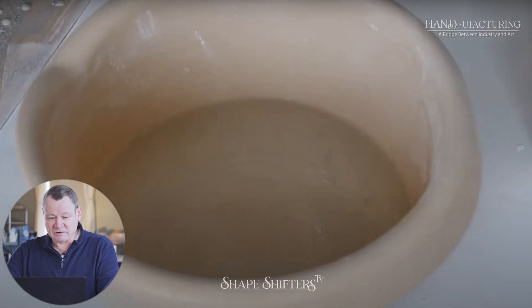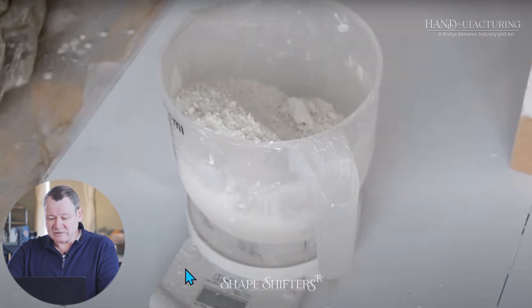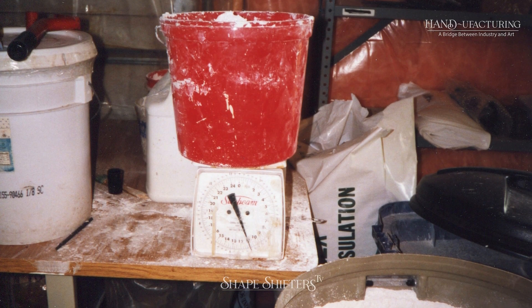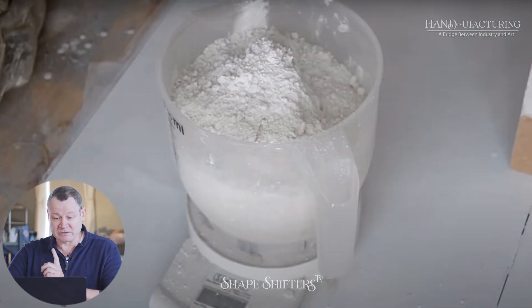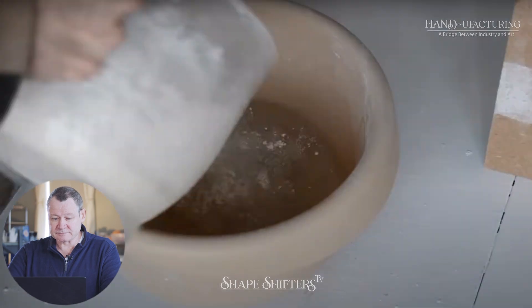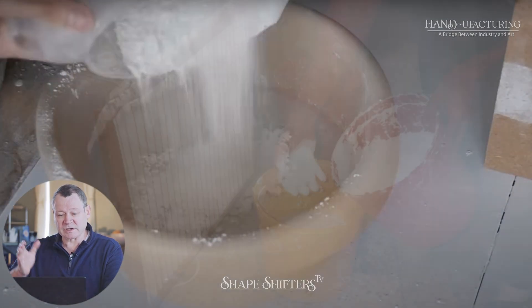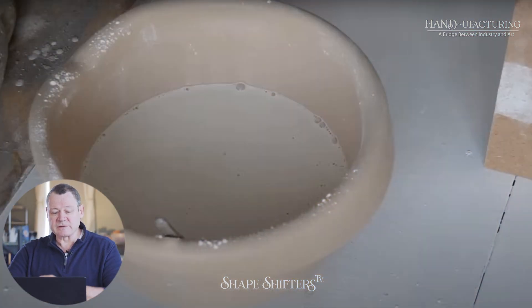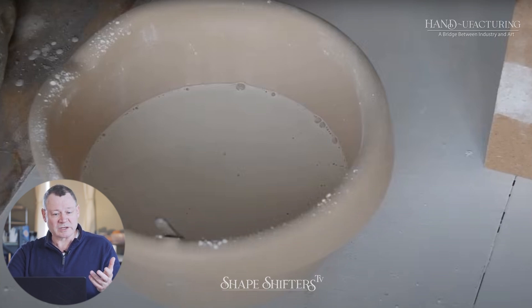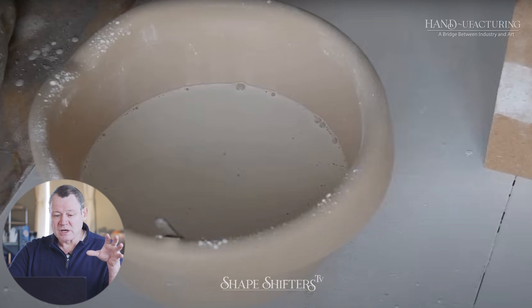Mixing plaster — water first. This type of scale is really not a good plaster scale. You really want a scale that's like an old fruit scale — the one that has a dial on the front with the platform on top. This'll work for small amounts though. Put it in slow. You want to keep a box fan near you to draw the powder dust. Now this video is sped up, and remember this is for the basics. The pros already know that when you put in the plaster, it should have been allowed to sit for three minutes — it's sped up so I can't really tell the timeline. And he's mixing with something that's not a great size spatula for mixing.